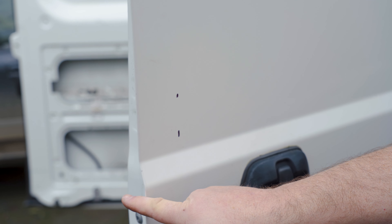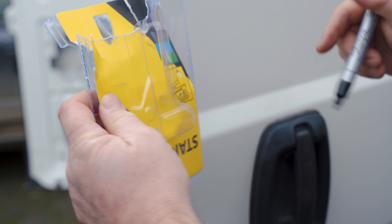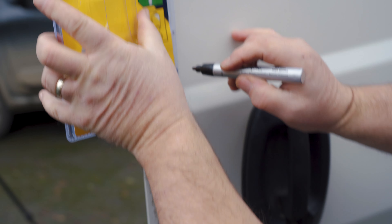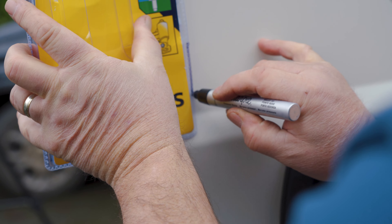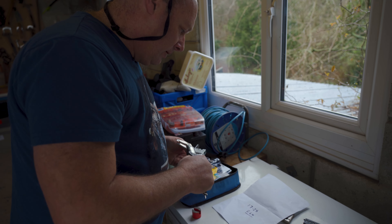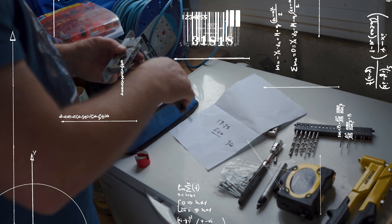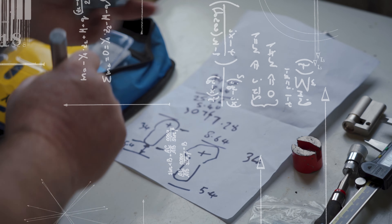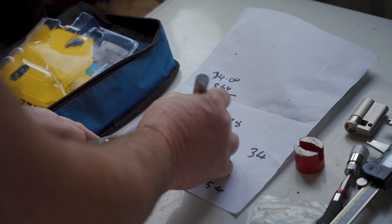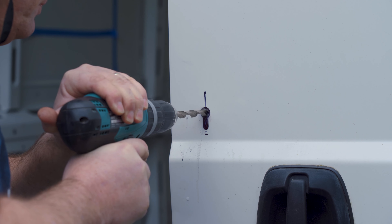We're putting in the lock hole for the outside of the door. The instructions give you 56mm from the edge of the door but don't tell you the vertical height — where to drill the hole or where to put the blocking device. So we just have to work that out. Drawing the center line, got 56mm somewhere in there, then we take the lock out and work out a position. Let's get the center of this hole: 17.28mm... 30.76mm from there to the bottom.